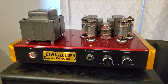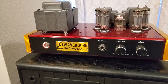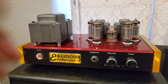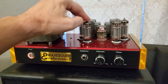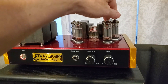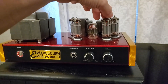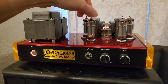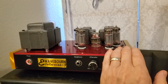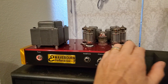This is the assisted single-ended version of the LY-3 amplifier with 6V6-type tubes. They are Soviet military 6P-1P tubes repackaged into a 9-pin bulb. Real 6V6 wouldn't fit in this pre-made chassis that I used for this prototype.